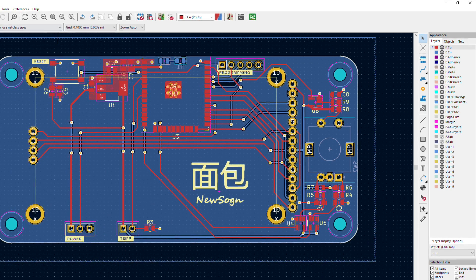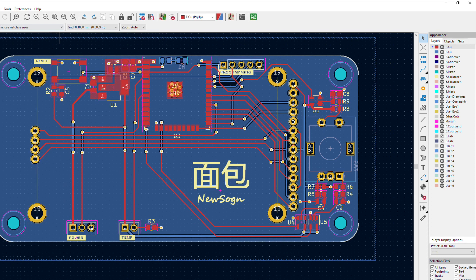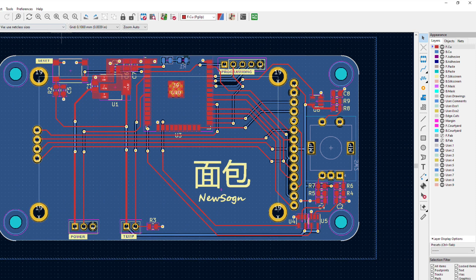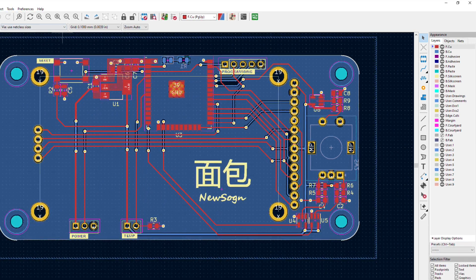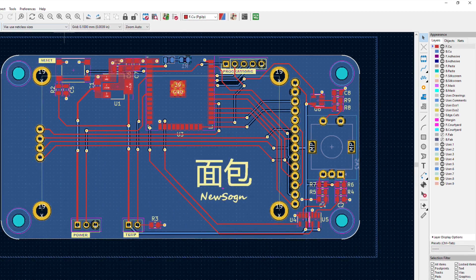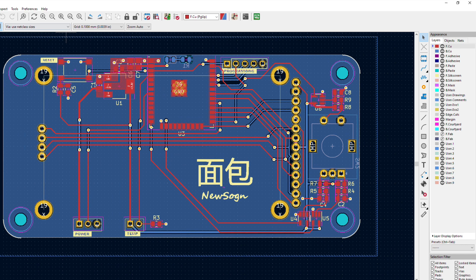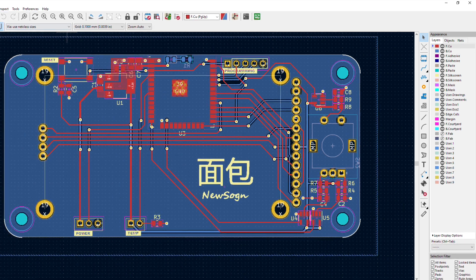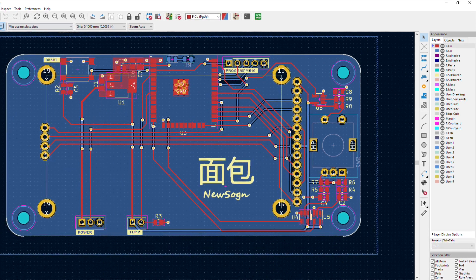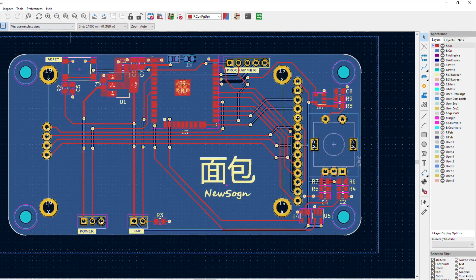Here's the layout for the main board. My first design was kind of a goofy shape and laid out really poorly. Also it cost like 35 bucks before shipping. Not sure why the engineering fee came into play, but I suspect it's because it was a four layer board that exceeded some sort of size limit. Because I really am that cheap I decided to start over. I ditched the four layer board because I'm using a WROOM module — it's just not necessary. There are no controlled impedances or anything. I tried to keep as much on the top side of the board because on a two layer board I didn't want to disturb the ground plane on the bottom any more than I needed to.